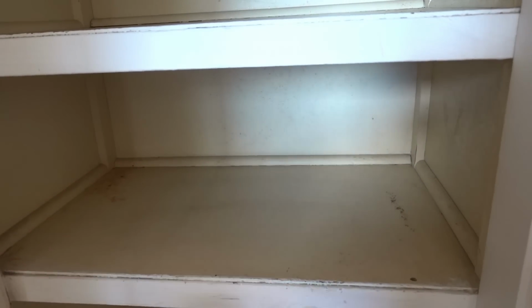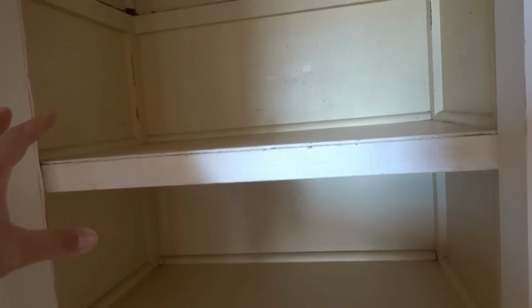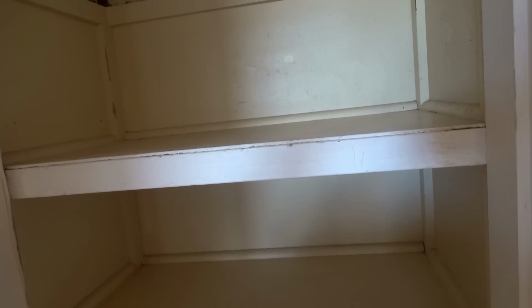Now you can see just how tight everything is here. To get in here with a brush and a little roller, it's going to be an absolute nightmare to go through all of this, every single section, all these shelves. So I'm planning on spraying all throughout here. Whether or not I can spray using the 511 tip or the 515 tip that they've provided us with this 150, I'm not too sure yet. Just depends. If it's spraying a bit too much, I don't want to cause any kind of runs or anything to go through this cupboard. So depending on how we go, I might include it in this video, or I might pick up a 211 tip probably tomorrow or the day after, and then I'll upload a different video. But for now, let's go test out the other ones and we'll see how well it sprays.